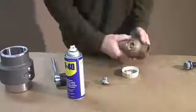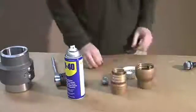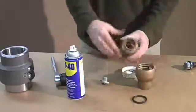When all the ball bearings have been removed, you can then slide the tail out of the body, which will give you access to the seals. In this case, we have an elastomeric O-ring, main seal, and a felt environmental seal.